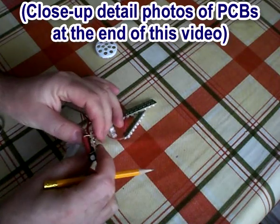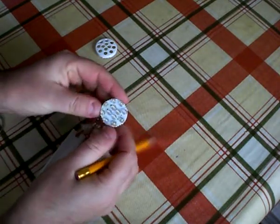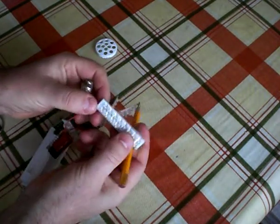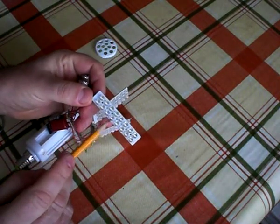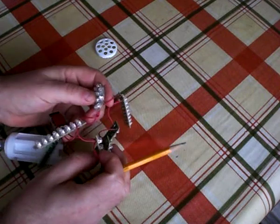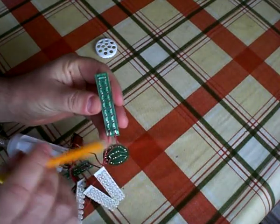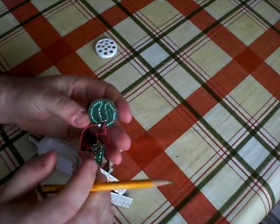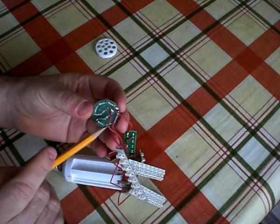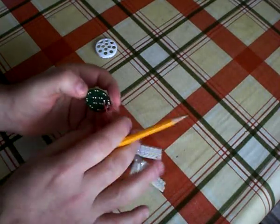Right, what have we got? There's a little circuit board here, and there's a circular PCB with 12 LEDs on it, and then there are a bunch of other boards with 16 LEDs each. So there are 6 boards with 16 LEDs and 1 with 12 — that makes 108. On each of the long circuit boards the LEDs are wired in simple series. On the end circuit board, they're also wired in series, with a wire going to the middle, running one half then the other half — so it's split into two separate little circuits.